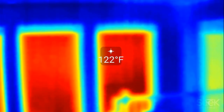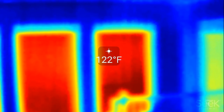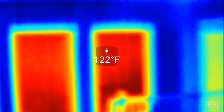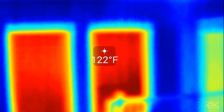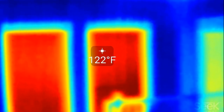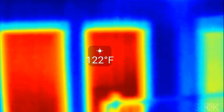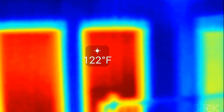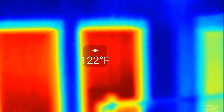To note: these 3M films were professionally installed by a 3M distributor. As you look online, some videos show how tinted glass keeps a chocolate bar or ice cream from melting versus untreated glass — it's somewhat deceptive. It doesn't take into consideration the convective looping that occurs, and it doesn't show how cold air heats up with the film and then rises. That heat doesn't actually touch the candy bar or ice cream. To make a proper test, it needs to be in a box where you can measure the temperature of the space with and without the film.